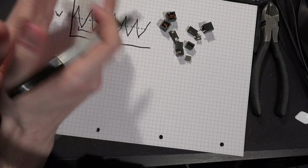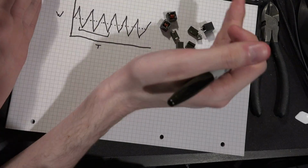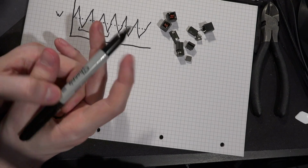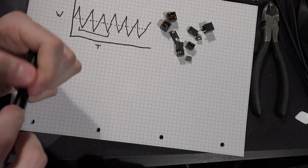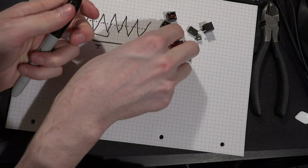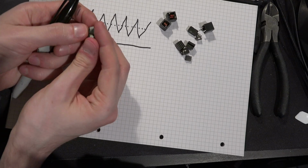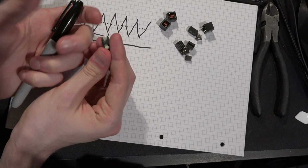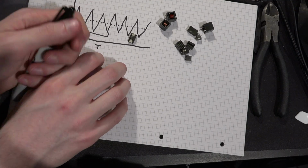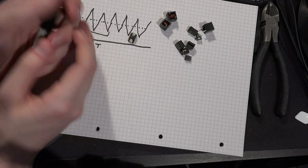As your FPS goes down, the spikes stretch out, right? The waveform stretches out, and your coil whine goes down in frequency. And at low frequencies, these aren't subwoofers. They're not going to make low frequencies very easily. So those you won't necessarily hear very much, because it's actually really hard for the core of an inductor to move around at 60 hertz, right? That's rather hard to do.